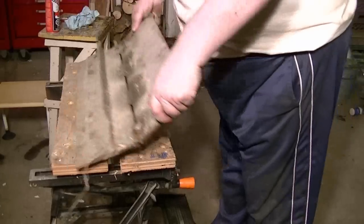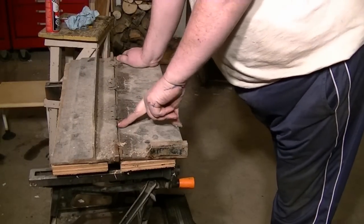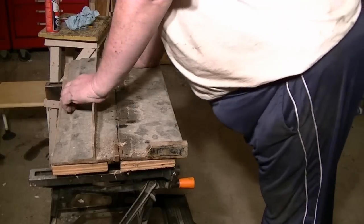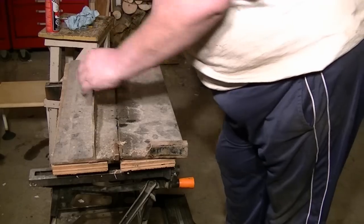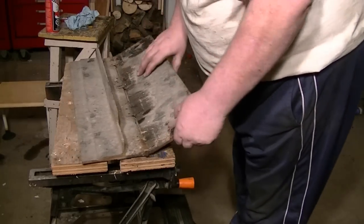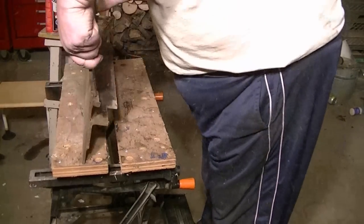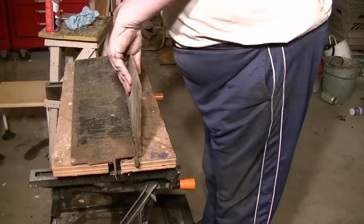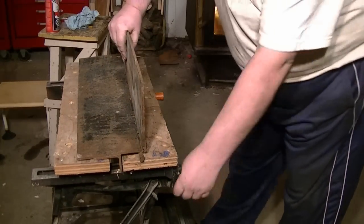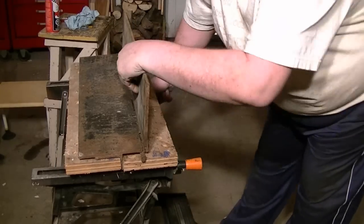I just took a couple pieces of quarter inch by 6-inch wide flat, and this is a 2.5 or 3-inch angle iron that I put on the bottom, and these are just cheap hinges I welded on. What I do with this, I drop it on there just like that. Crank it shut, and it holds it.